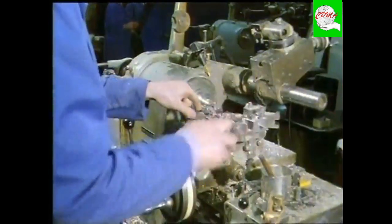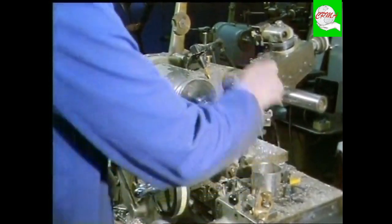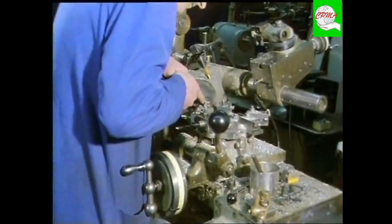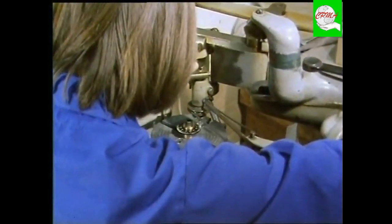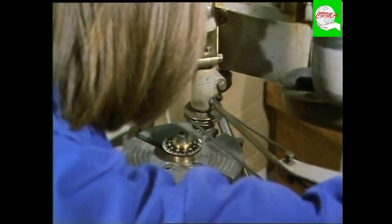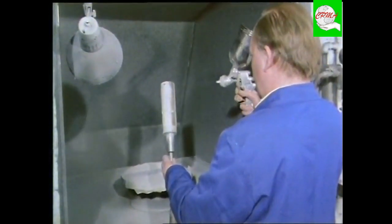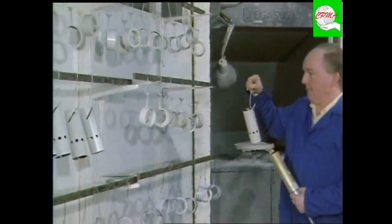Certain components are machined on lathes. The final cut is carried out with a diamond tip tool to produce a good finish. Scales and numbers are produced by engraving. The lenses, which have been manufactured separately, are mounted into their turrets. The outside of the instrument is painted to give an attractive and durable finish.